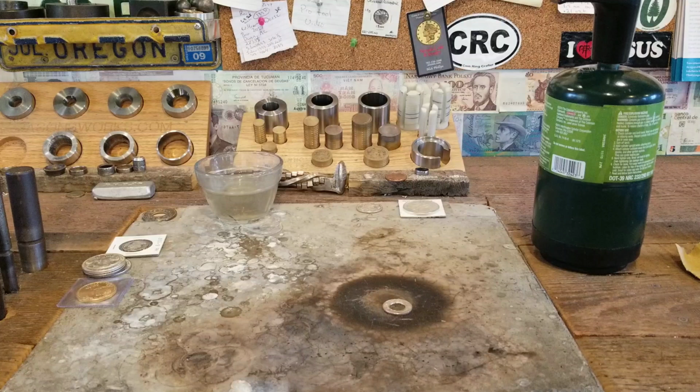Okay, let's get started. First things first, let's take a look at all the tools and supplies we're going to need. A ring stretcher reducer machine, 9-piece Harbor Freight punch and die set, steel or aluminum mandrel, ring sizing gauge, propane torch, a deburring tool, 0.9 by 1.0 17-degree die by Jason's Works, Ross coin alignment card, universal stabilizer folding cones and spacer set by Jason's Works, and also a stainless steel starter cone from Jason's Works. That's about it for all the tools that we're going to need.